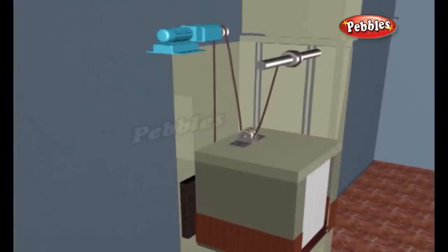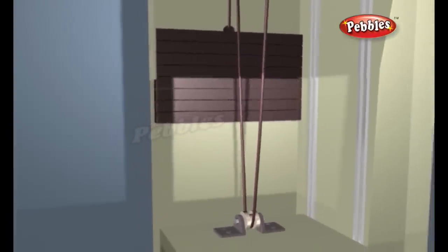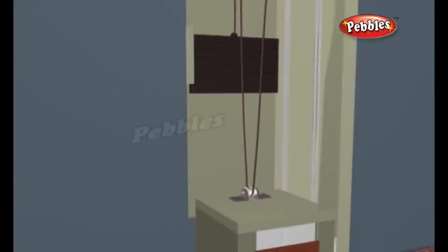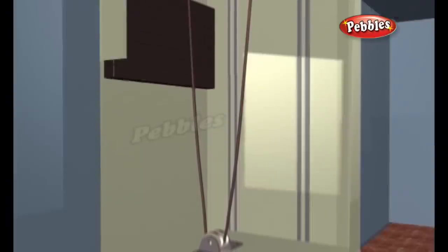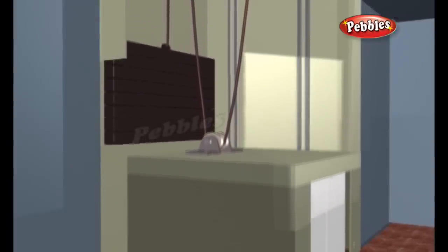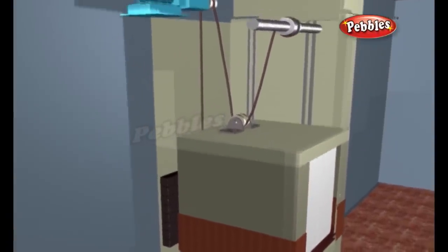The purpose of this balance is to conserve energy. With equal loads on each side of the sheave, it only takes a little bit of force to tip the balance one way or the other — basically, the motor only has to overcome friction. The weight on the other side does most of the work. The balance maintains a near-constant potential energy level in the system as a whole. Using up the potential energy in the elevator car builds up the potential energy in the counterweight, and the same thing happens in reverse when the elevator goes up.